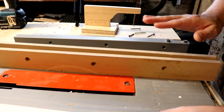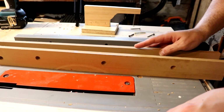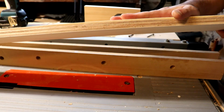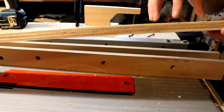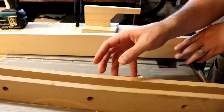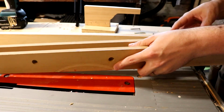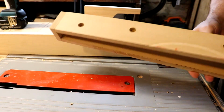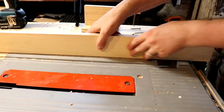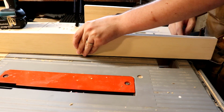And I'm going to replace the MDF, which I think, what is this? I don't know, 5/8 something? I don't remember. I'm going to replace it with this 3/4 of an inch Baltic birch plywood, and it should be much stronger. Basically what we want to do is do the same thing as this, where you see the end here. I want to cap this off. I'm basically going to make them exactly the same, except I'm just going to make it out of this plywood, and then I'll just do the same thing, and that should strengthen the joint here a bit. And there's a little bit of a gap, I might have to fill that, but yeah, that's what we're gonna do.